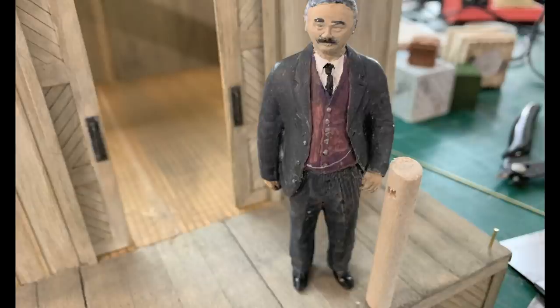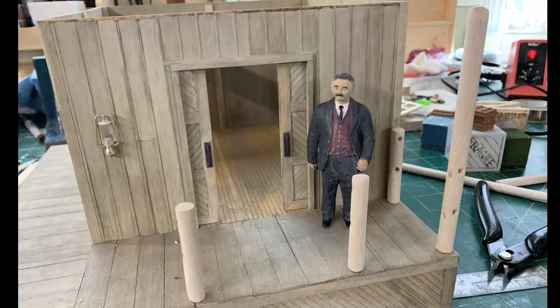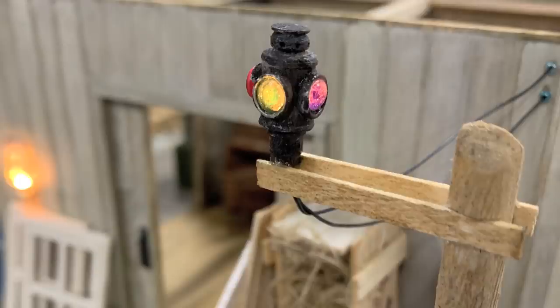Right. Okay, on to the railings now. This is phase one of the railings. The railing around the front side of the dock that's out on the actual dock, the part over the pond, is going to be a rope railing. And the vertical poles for this are mounted this way. I've drilled into the loading dock and put a brass pin in place, and then center drilled the poles themselves so that they mount over those pins. Otherwise, they'd get knocked loose all the time.